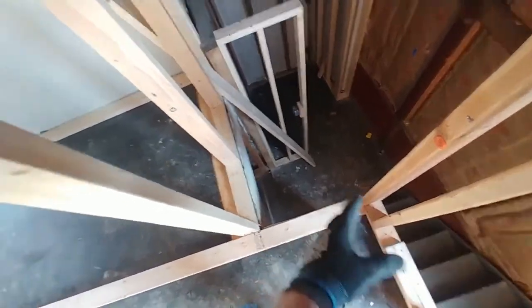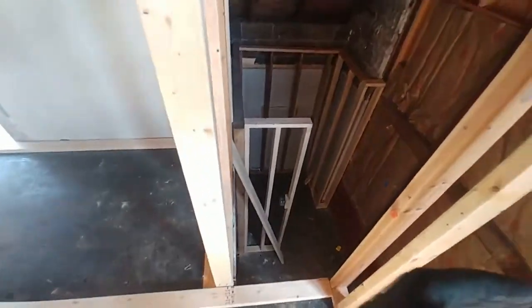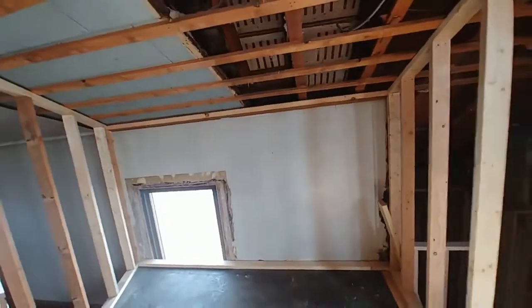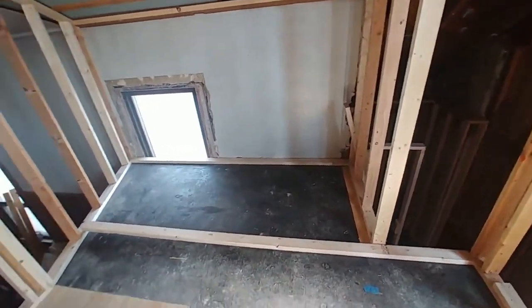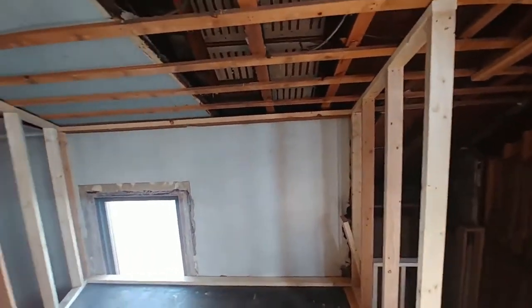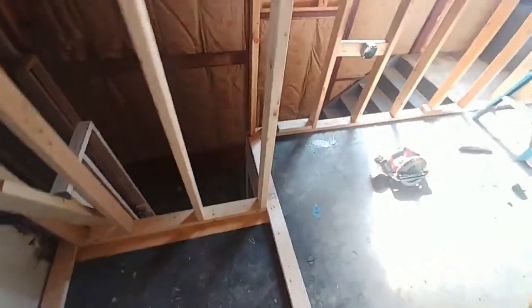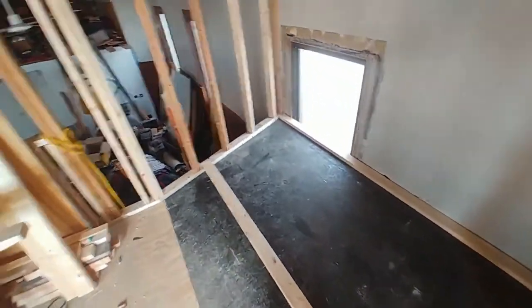Just cut it off at the knees, make a couple weird studs so the far side of it works out perfect with that drywall, the near side of it is all the same, and we preserve the plumb, level and square quality of this room, which is going to come into play in other ways. It's going to come into play down the road forever. People take rooms to be square and plumb and make their plans and their furniture and everything like that, providing that they are. And when you get into one that isn't, it's a real pain in the ass. So let's come back and see how this little custom wall turns out, but I think in the end it's going to make our life kind of real nice and easy.